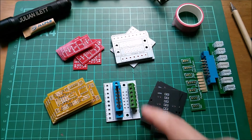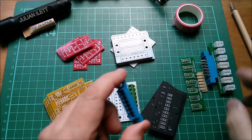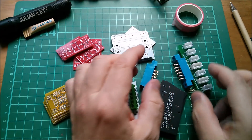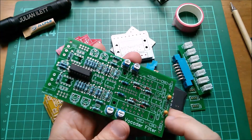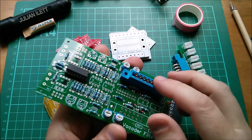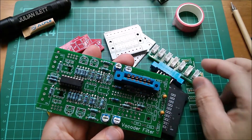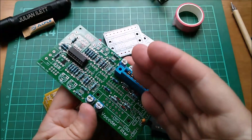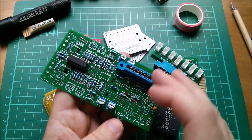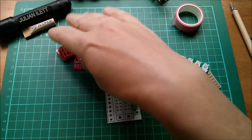Because I don't have any three-pin terminal blocks there's not much point starting to assemble this, and in any case I want to keep these connectors free because I use them for two different things - including my vocoder filter boards. I've added a few more components to the filter board since my live stream. The connectors go here and then a filter board plugs in there as a daughter board. The whole point of having pluggable daughter filter boards is so you can mix all the filters up, so the speech filters don't match the music filters - that's going to sound awesome.